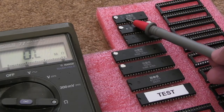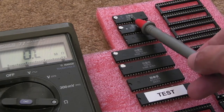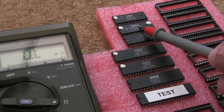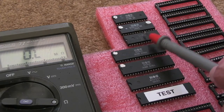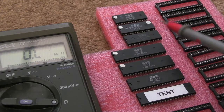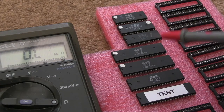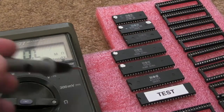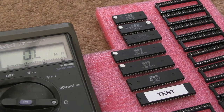I've got an old SID that I found when I was looking for my spares as well, from the C64C — faulty, gives a black screen. A PLA gives a black screen, and a PLA I've just removed from another board that gives multicolours and things but initially gives a black screen. I just like to try and compare, do measurements where I can, compare from chip to chip and against working chips, just to see what sort of readings I get externally.